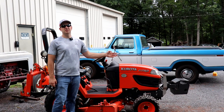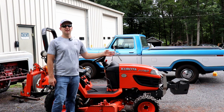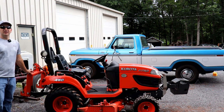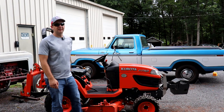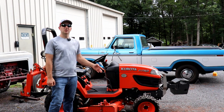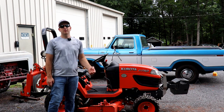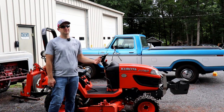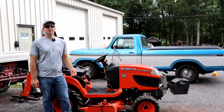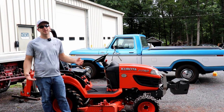I have just shy of 300 pounds of weight bracket and grill guard on the front, so that's 1,850. Then about a 70 pound quick hitch on the rear of the tractor brings us to 1,920. The mower deck on this tractor is around 275 to 300 pounds. So you can see we're already going to be exceeding the limits of this single axle trailer — coming in around 2,200 pounds — and that's without an attachment on the rear.